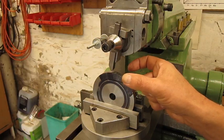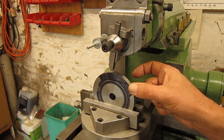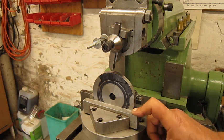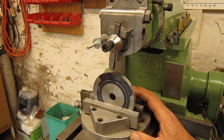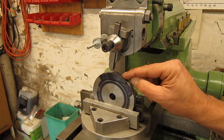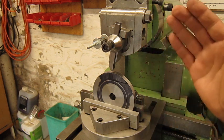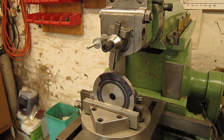We have a stroke length of 30 millimeters — it's a bit more than one inch. I'm going to run it at 160 strokes a minute, which is the maximum of this machine. That gives me a cutting speed of about 8 meters per minute, which is way too low. So we're probably going to have some chatter problems. But we'll see — I'm going to take light cuts and we're going to see what happens.